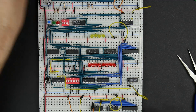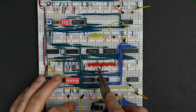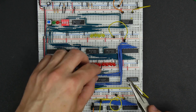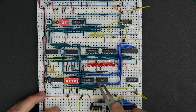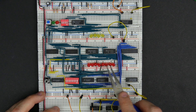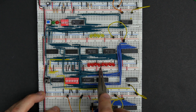Let me pull the power off and do that — shift over. If this chip wasn't powered, which it wasn't since the power was not connected, then its outputs would be floating. And the inputs on these chips default to ones, so whenever we do a write, it just writes all ones. So that explains the behavior that we saw.